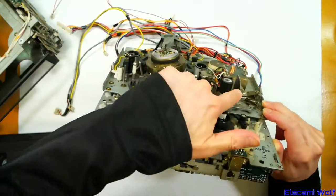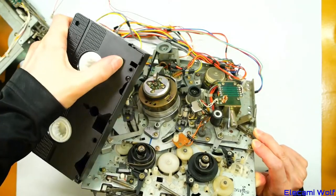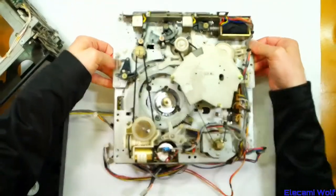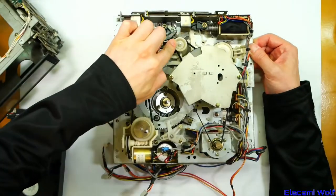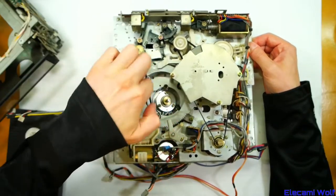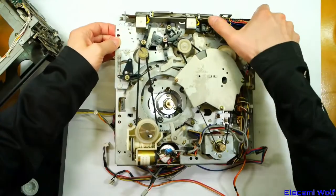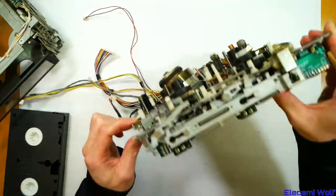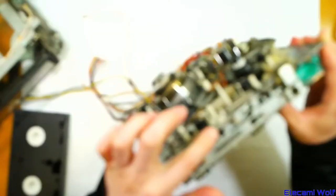This mechanism here is for opening the cassette flap — it will push on there and into that little bit when the cassette is lowering onto it. The capstan motor also probably does the take-up, and the loading motor here operates these loading ring gears and also engages on this, which looks like it can be used for rewind or fast forward, depending on what these two solenoids are doing.